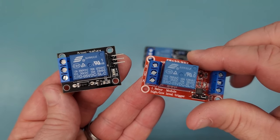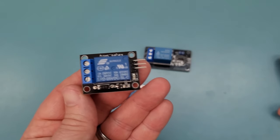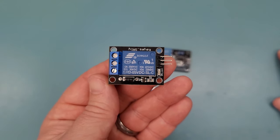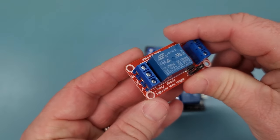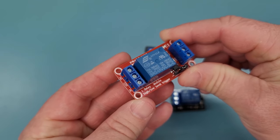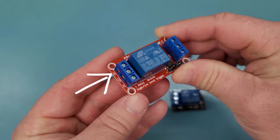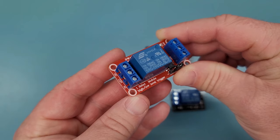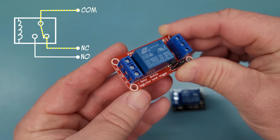We can also see what the current rating is at different voltages. It is important to remember that this is the rating that the manufacturer of the relay gave that specific part, and is not necessarily the appropriate rating of the module itself. To the left of the relay, we see a three-position terminal block. Here is where we'll connect the load that we want to control with the module. These terminal positions are labeled NC for normally closed, COM for common, and NO for normally open. What this means is that when the relay is not active, there is an electrical connection between the normally closed and common positions.